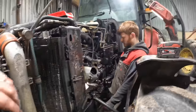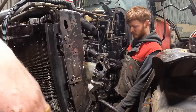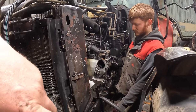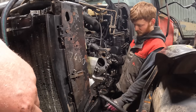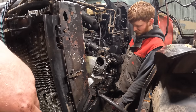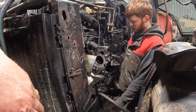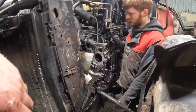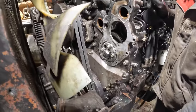1077. But from what Murphy was saying, she's not doing what a pump that's knackered would do. Generally they get that very hard start. It doesn't do that little brrr when it turns off and something else. So that's why we think the timing should be wrong. Hopefully it's not hard start. Yeah, it's not hard start. Hopefully this solves that problem and gets us back up to proper power. And then the front crankshaft seal has to be done next.